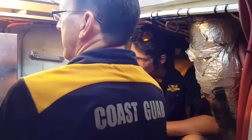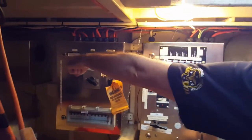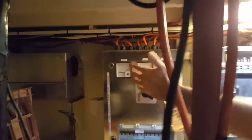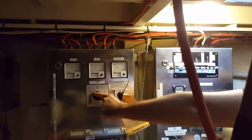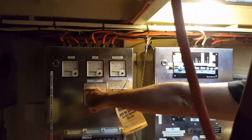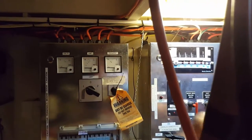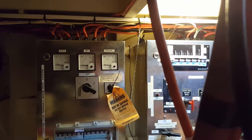We're going to open up the electrical system. On my far left is the battery charger system, and that's currently in the off position because there's no lights on. The switch for the battery charger is around the corner. We then have our 240 volt system, currently set to shore power. We can see it's not on because there is no power coming through the system — you can tell from the gauges.